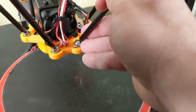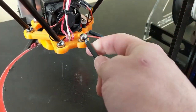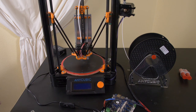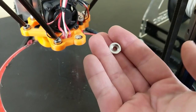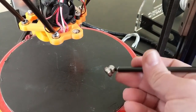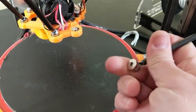And that's why I moved on to these magnetic ball and socket joints. These are actually really cool. They are a zero lash system for sure. The way they work is there are these special neodymium magnets that have a conical recess in them. I believe these were originally designed to handle flathead screws so that you would have a flush mounted magnet for something.